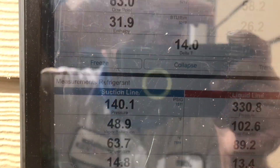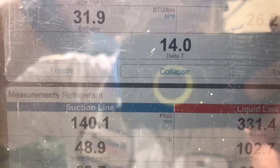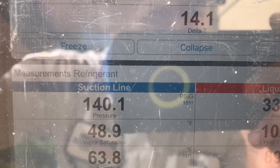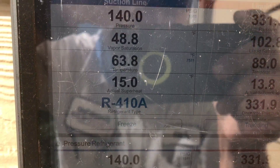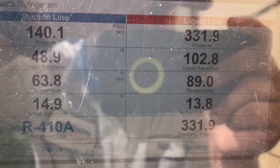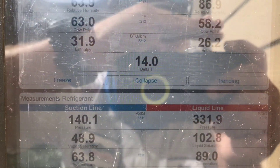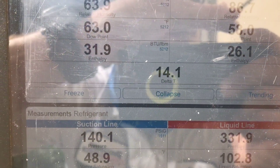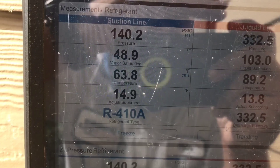If you weren't going off subcooling and were just going off suction pressures — the suction looks a little high, which could be a couple different variables — but the head pressure looks okay. One of the things I always pay a lot of attention to is the line temperatures. If you weren't going off the subcooling and you saw that line temperature at 63, you'd automatically assume it didn't have enough refrigerant, so you'd want to put a little more in it, especially because the Delta T is 14. The pressure showed it's pretty dialed in, but it's worrisome it's only getting 14 right now because it's really not that hot outside.